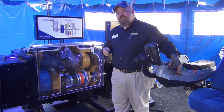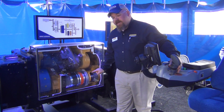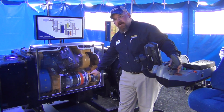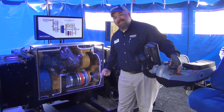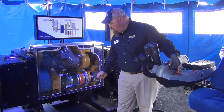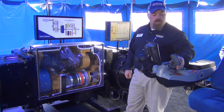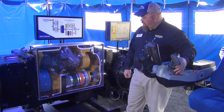We have seamless changes through the four ranges in this transmission. As you can see, the orange clutch here is spinning — it's not engaged yet, not activated. It's waiting for clutch number two to speed up to it, and then it'll swap over and we'll have a smooth, seamless transition.